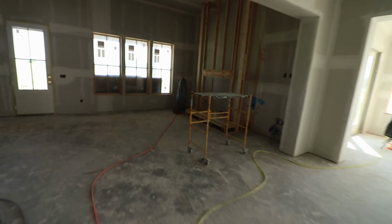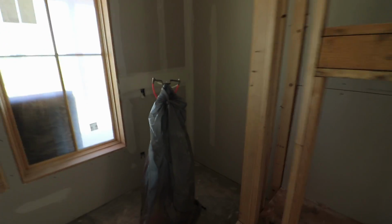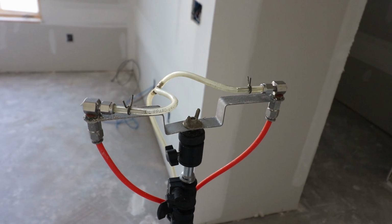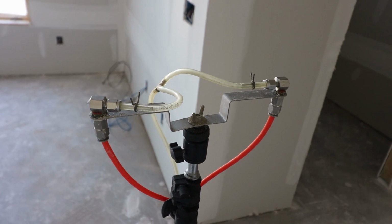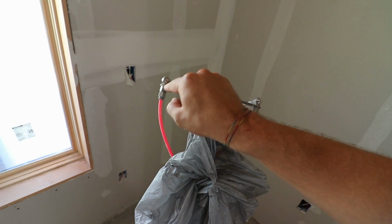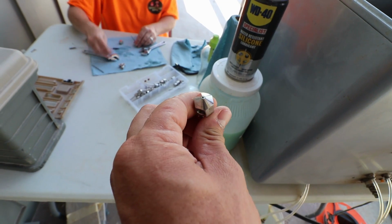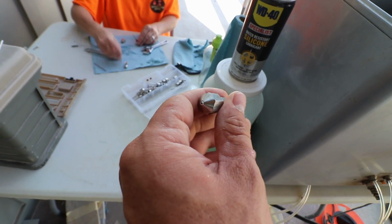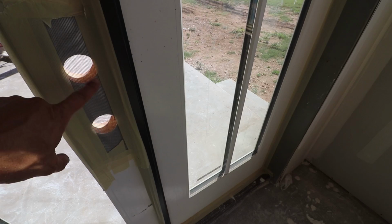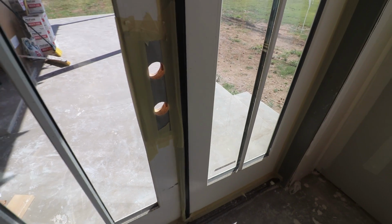over to these different zones which atomize it. So this sprays out basically an airborne liquid caulk. The product goes through here, the air comes up through here, and it's atomized through this orifice. And we're going to show you in a time-lapse video this screen here getting filled with AeroBarrier. So it's going to completely seal that void there.